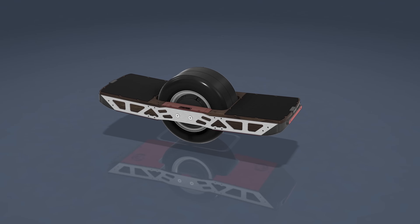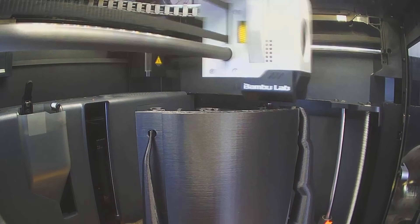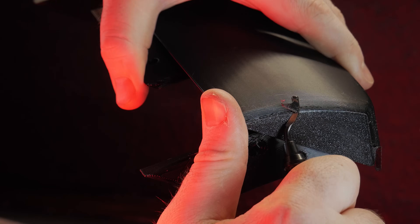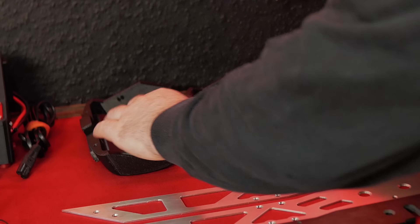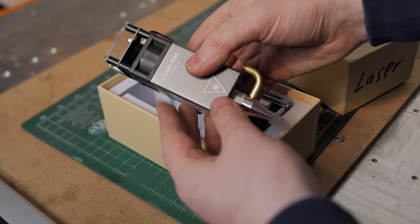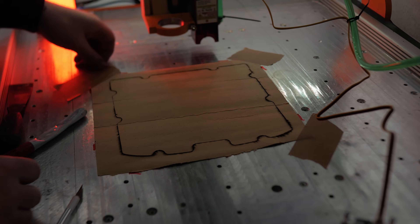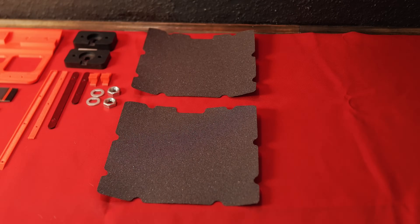The front and rear bumpers are engineered with a positive fit design, meaning they lock into place precisely but are still designed for quick and easy swaps. They constantly drag along the ground, so they wear out quickly. The support material with its tree-like structure looked absolutely wild — it was nearly too cool to break off, but what's in the way has got to go. About a year ago I bought a laser module but never used it. Today was the day. I removed the spindle from my CNC and mounted the module in a bit of a makeshift setup. It cut through the grip tape very cleanly, and thanks to the dust extraction there wasn't much smell either.